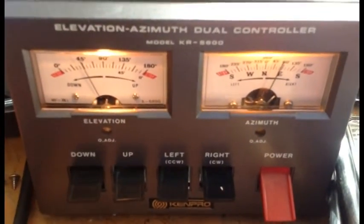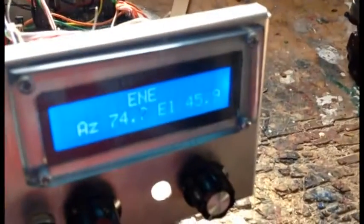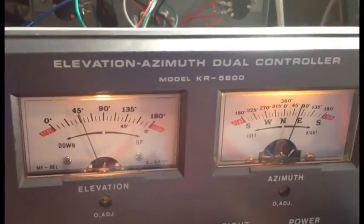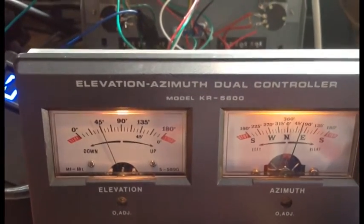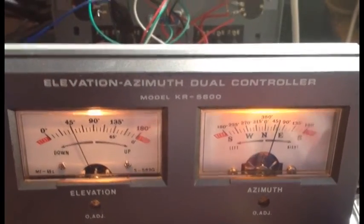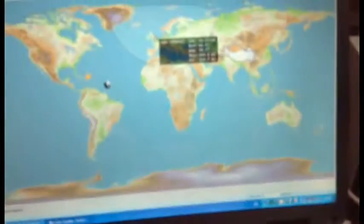Look at our Arduino receiving data nicely - all is good - which all tallies up with this. So we're basically 45 degrees azimuth and just a little off 90 elevation, which is true: 45 and 74. A little below 90 - can't really see but it's getting on for about 73 degrees. These increments are about 15 degrees, so each line is about 15 degrees. We're coming back down to about 60, which tallies up with 60 there, 45 degree elevation, and so forth.